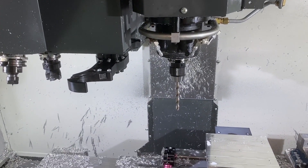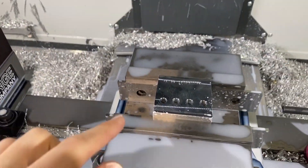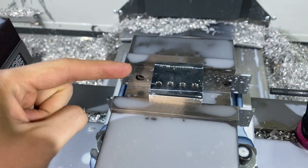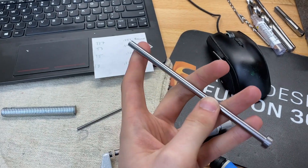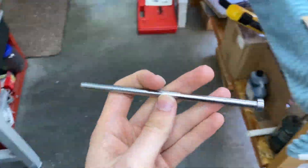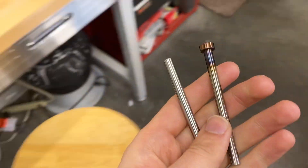It's not fun, but I'm continuing work on the mold. It's a new day. We are reaming holes and there's a lot to talk about. Before I start my next cavity block I wanted to dial in some reamers — I'm working with a quarter inch and an eighth inch. These are quarter inch ejector pins from MSC, and I also bought some from McMaster.